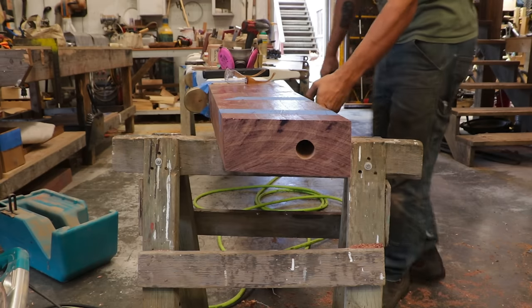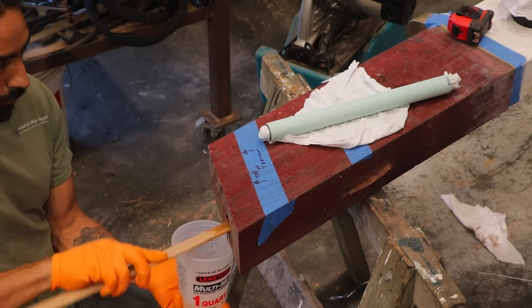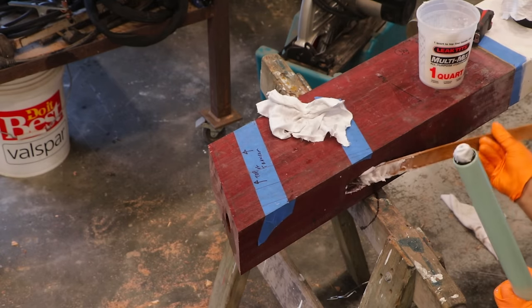And that final diameter of the hole is to accommodate a tube that we glued in with epoxy. The tube is of G10, so it's a composite fiberglass tube. We won't need to paint it and protect it as much as you would if it was just exposed wood in the hole. And it also enabled us to put a bearing in one end of that.